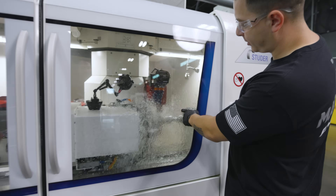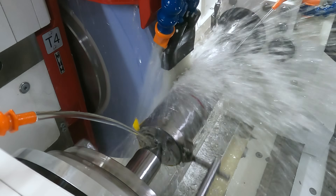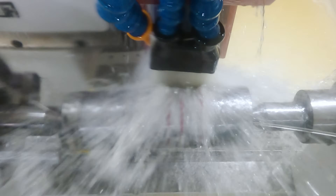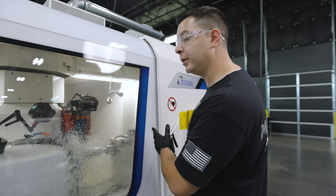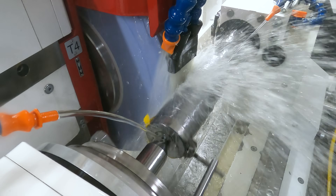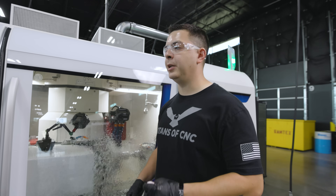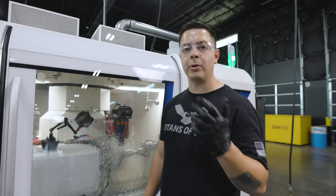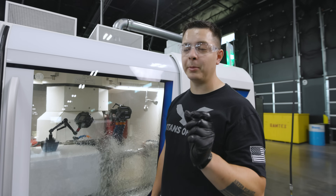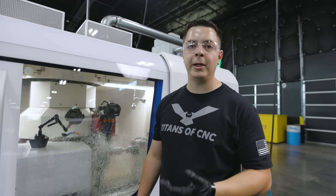As you can see, we marked the whole thing up. Only the left side is getting ground right now. When it traverses back across the other side it's going to clean everything up. Now we know we've got a beautiful cleanup all across the part. But if you don't have a good visual of your part and you make an adjustment and it doesn't grind anything away — or grinds a little on this side and a little on the other side — you could be chasing your tail all day long.